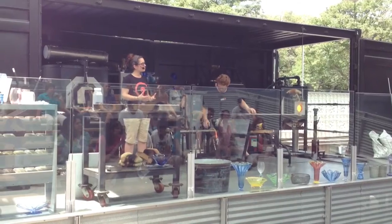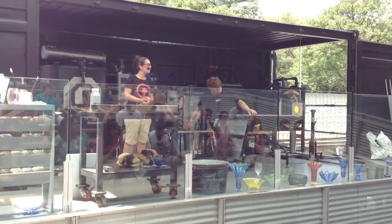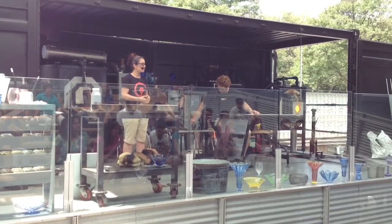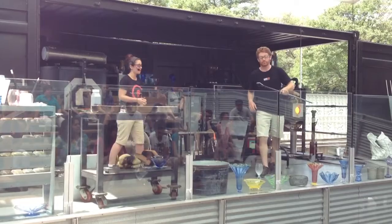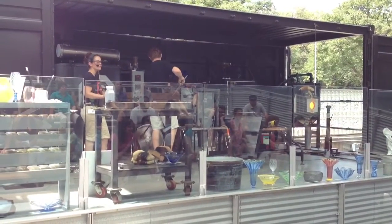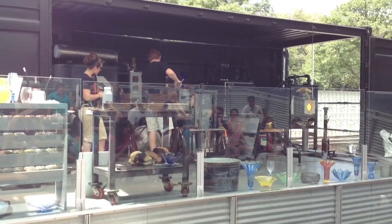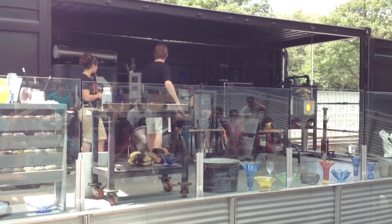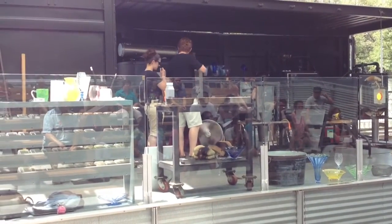As glass cools from that fluid molten state at 2,000 degrees Fahrenheit, it sets up and becomes more rigid. Our glass is actually considered cold at roughly about 1,000 degrees Fahrenheit. We consider that glass to be cold because it's as rigid as the glass is going to become. So Dane waits for us to have our starter bubble close to that temperature point so that it can support the weight and the heat of a new gathered glass.